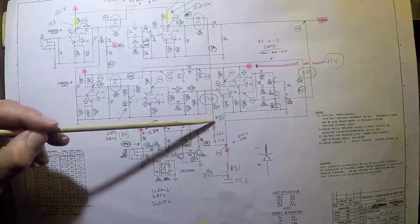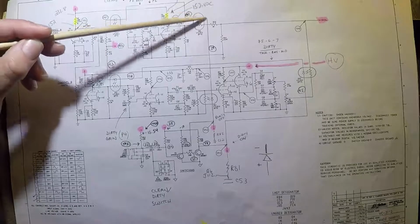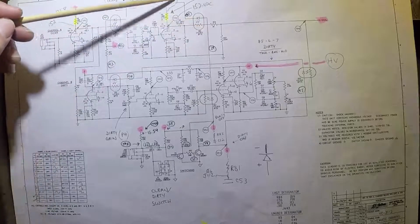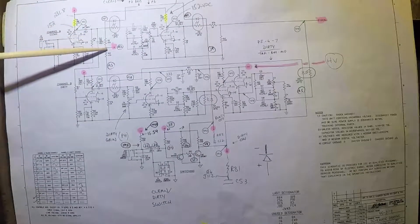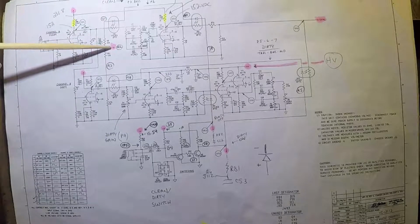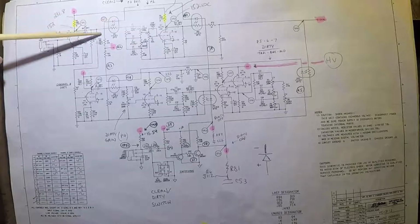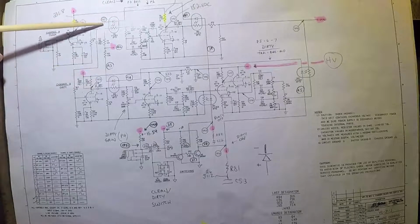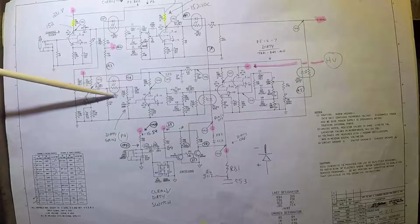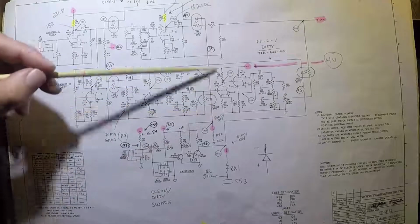And if this circuit is on right here, you can see that it comes up here and it'll turn on, I'm sorry, the LED. Comes over here, it turns on this LED. So the circuit passes through both LEDs. Then it comes back over here, and it dumps off to this -10 DC volts, right? And if you look closely, it looks like it's a complete loop, and it kind of is, because look, it's just that same LED circuit coming back down here and going through the LED of the Opto-Coupler in the dirty circuit.